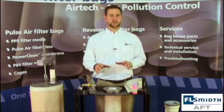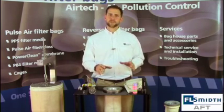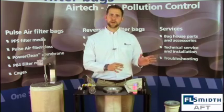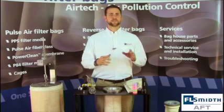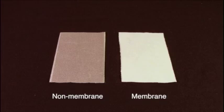This step is not as simple as it seems. Many filter bags are equipped with an EPTFE membrane that is laminated to the surface of the fabric. This membrane is a very fragile product and must be handled with care. Membrane is a great product which allows for greater filtration and dust release without having to pre-coat. However, these benefits only exist when the membrane is fully intact. That is what makes the handling of membrane filter bags so vital.